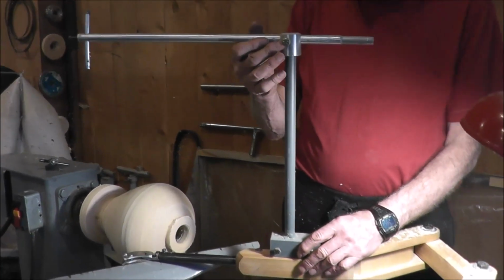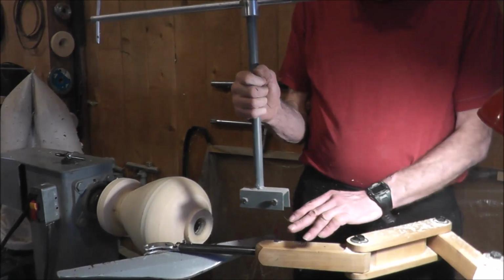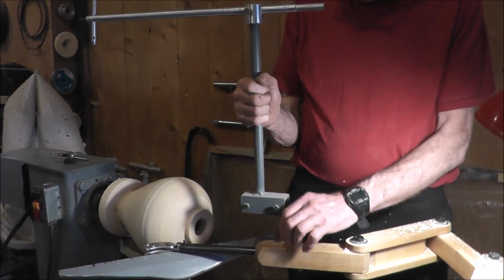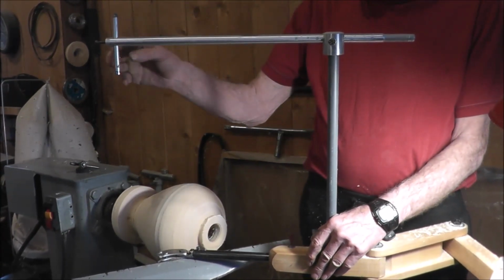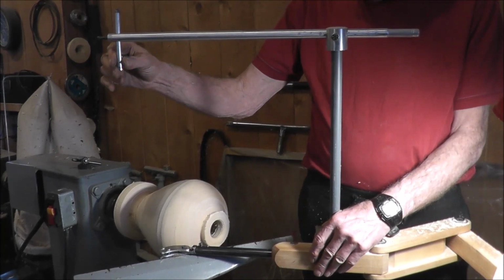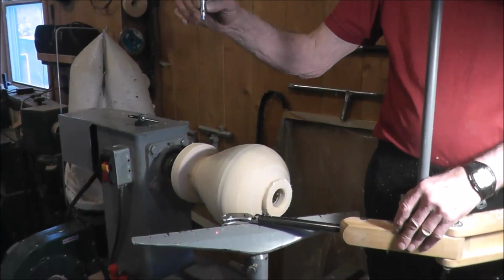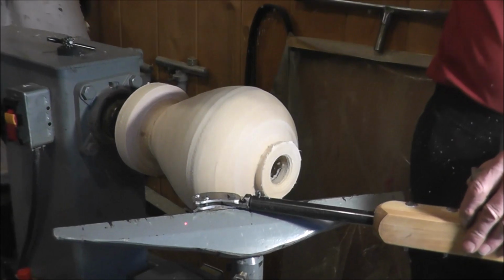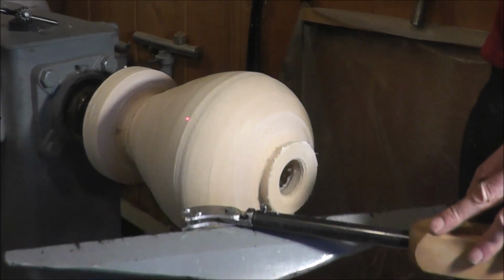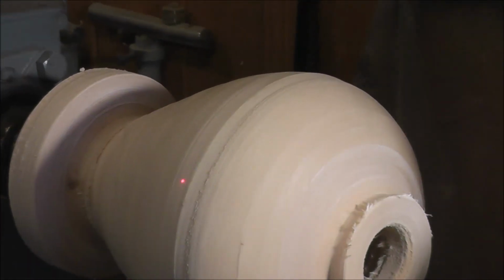this was a laser assembly that I used for the other first boring bar that I made, so it could be attached to here, it could be a piece glued on here, so I just have to make a laser attachment. The idea of the laser is you adjust your laser so you're just off the point of your lathe bit, and you can tell how thick it is. So when that's on the thing, you've got it thicker, and just as it comes to the outside edge and drops off, you know you got to that thickness.